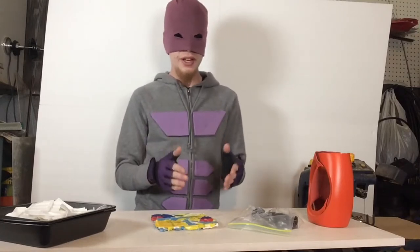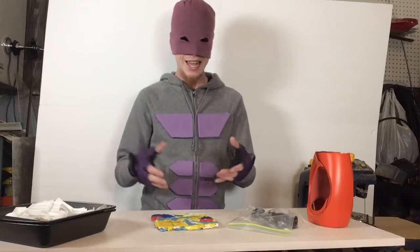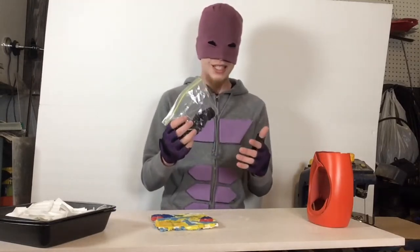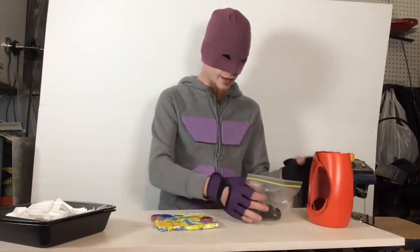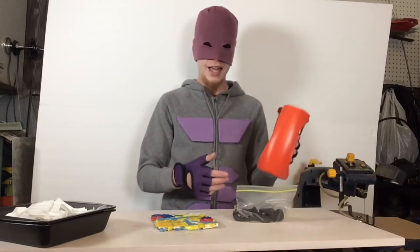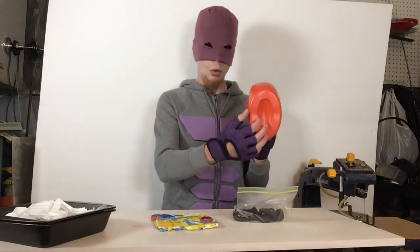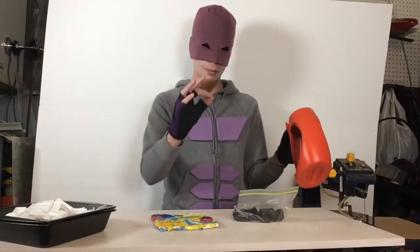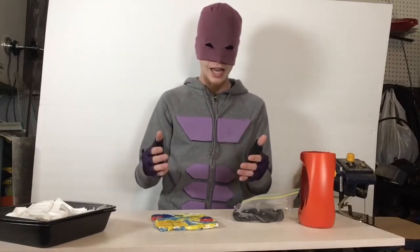You're going to need a toaster oven or panini press to melt the plastic down into the shape you want. The plastic comes in many forms — bottle lids on most pop bottles will be HDPE, as well as detergent, shampoo, and yogurt bottles. Look for the HDPE letters on it, or a recycling triangle with a number two in it. HDPE is number two plastic, high-density polyethylene.